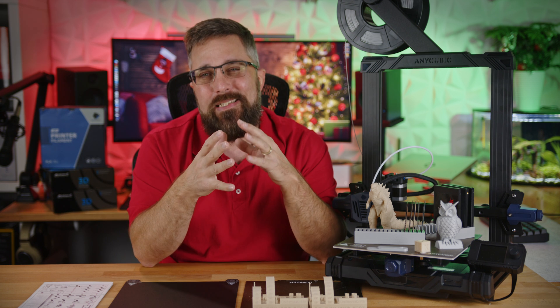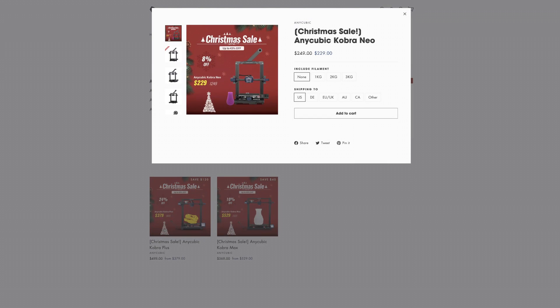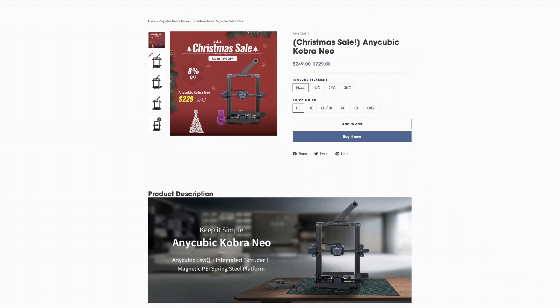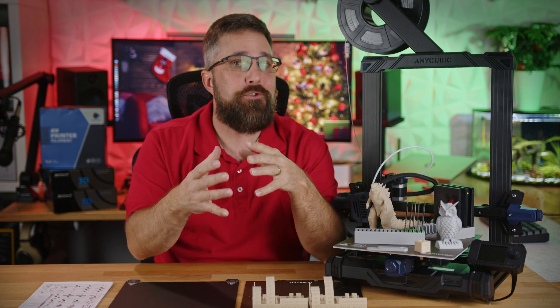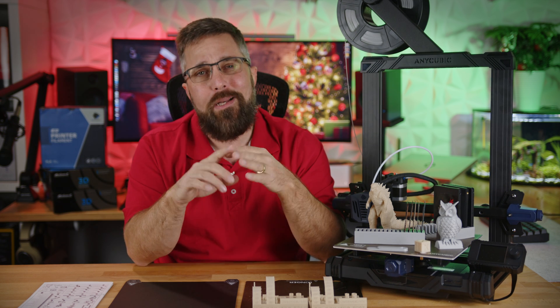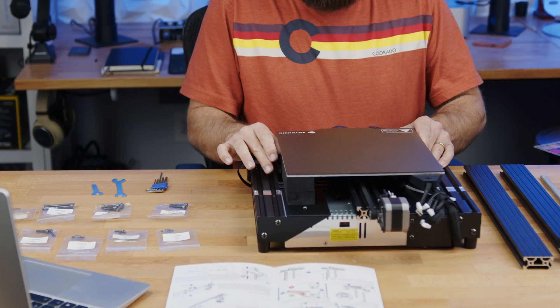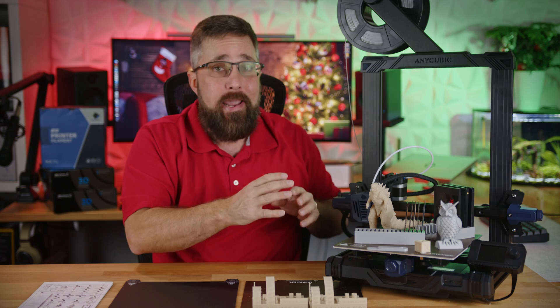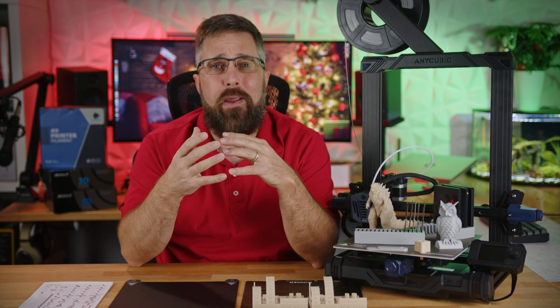However, with the Cobra Go, the savings aren't as significant. It's basically just a cheaper version of the Cobra Neo with a regular MSRP of $209 compared to $249 for the Neo. The Neo does have a few upgrades like a direct-drive extruder and a double-sided PEI plate, so that accounts for the price difference. One of the other benefits of assembling your own printer is that you gain a better understanding of how it works, which can come in handy for maintenance, repairs, or upgrades. But with the Cobra Go, you're only really assembling the gantry, while the base with the mainboard, power supply, hotbed, and the printhead are already fully assembled — and those are the parts most likely to need maintenance, repairs, or upgrades.